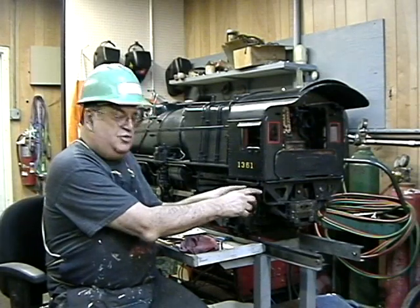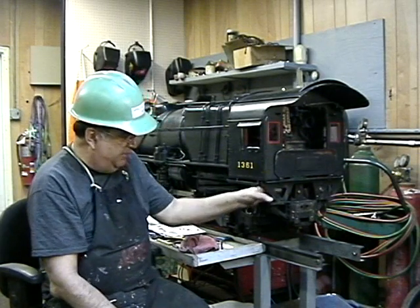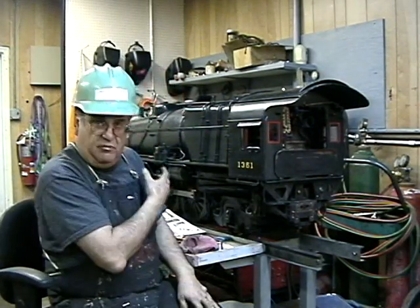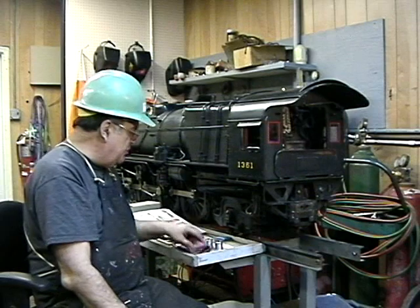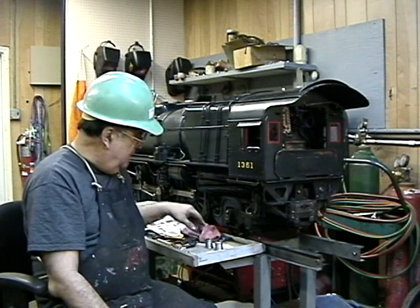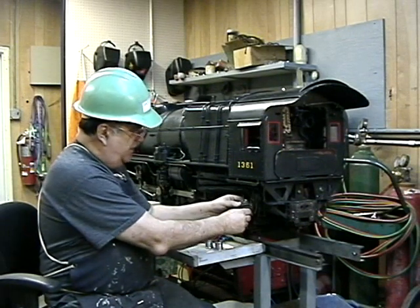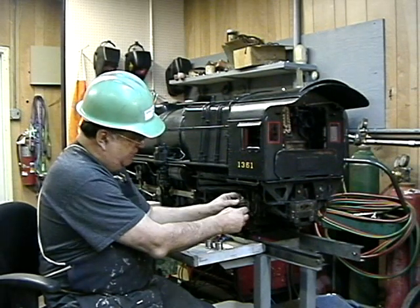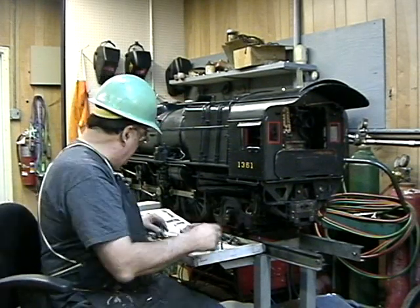Right in this area here there were two cylinders that had a piston and a crankshaft and it turned the mechanism. It was up in this area, and then it went with a drive shaft back through the tender with universal joints and so on, and turned the auger — which is like an Archimedes-type screw — and brought the coal up. We're going to make a dummy; you could try to make it work but it's not worth the trouble. The one problem I had was when I set it up before, I had the injector set up right at this area here and it seems to be right in the way, so I have to move it up a little bit — and actually that's where it was on the prototype. I'm going to move it about roughly an inch forward. I had to change some of the piping in order to get the stoker engine in here.